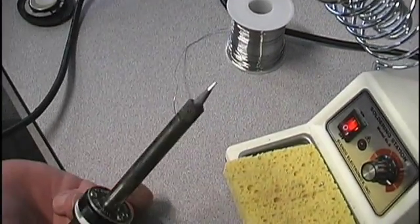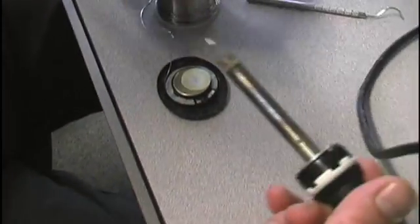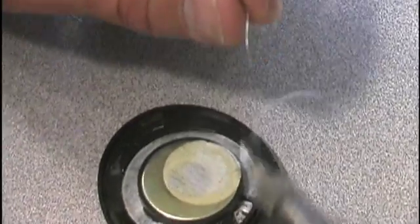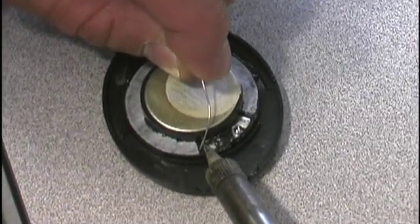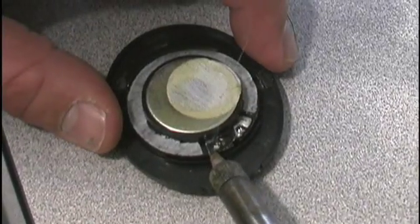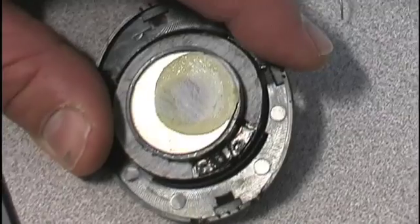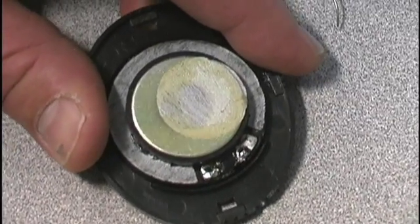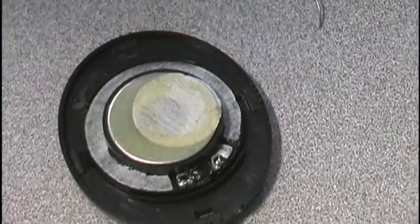What I'm going to do is take a little bit of solder to transfer the heat — put it on the tip of the soldering iron — and come down here on my solder joints and melt a little bit of solder on there to transfer the heat. You can see it gets molten and shiny. Before, those two connections weren't shiny; now they're shiny, which means I've got good clean solder ready to solder the leads on.